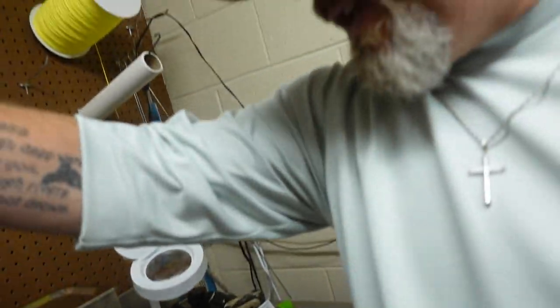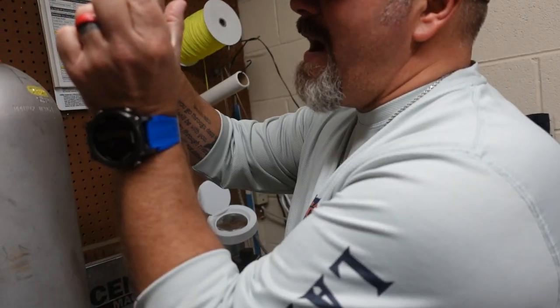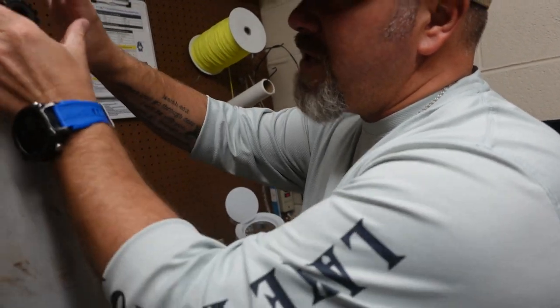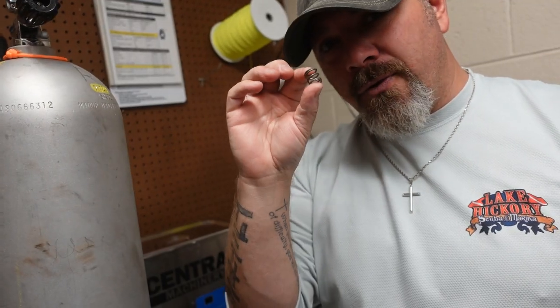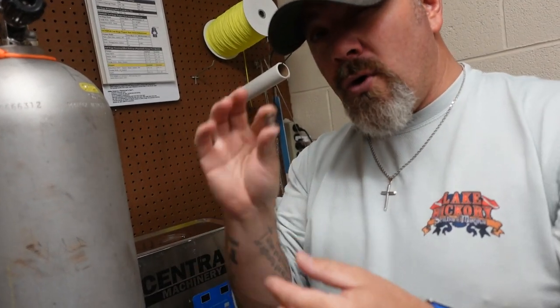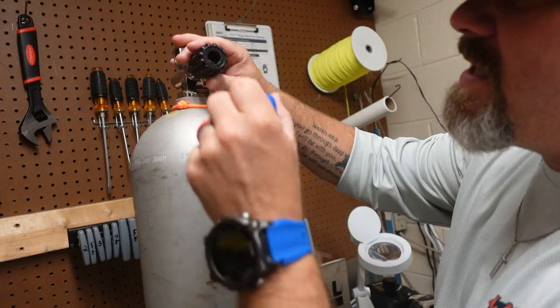So what is actually wrong with this valve up here? I suspect that it's missing the spacer, which means that the turn wheel is all the way up against the valve body itself. And then I'm going to say that either the spring inside here is damaged or it's the wrong size spring. So let's go ahead and take this one off and see if that's the case.